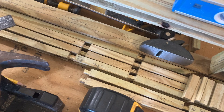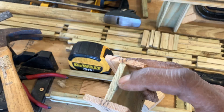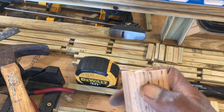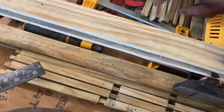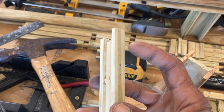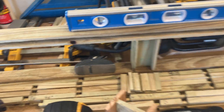When you're dealing with this gun you're definitely going to need safety glasses. Every now and then you miss the board, and working with this quarter inch you've got to get really good with the gun — it's not easy hitting that quarter inch going through this board and landing right there. If you over-drive it, it's going to come out the other side. I could pull out the misplaced brad, but I'll leave it in — I'll cut this piece and use it for braces and other structural things.